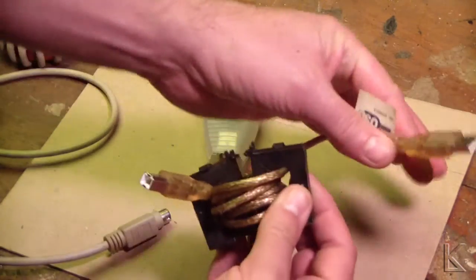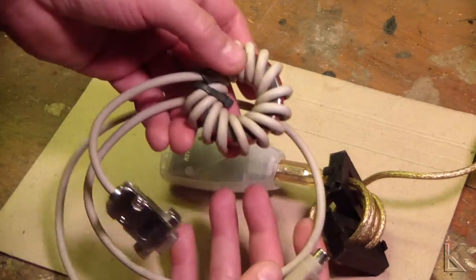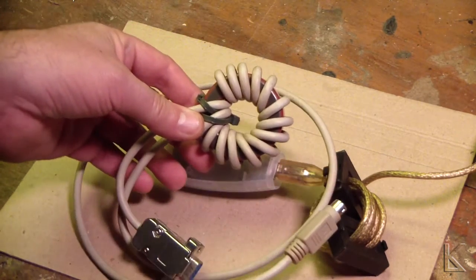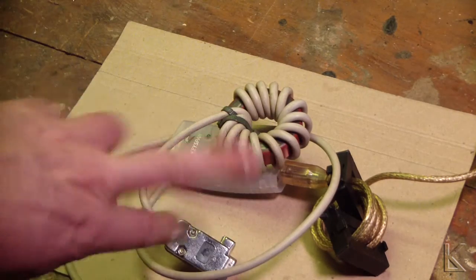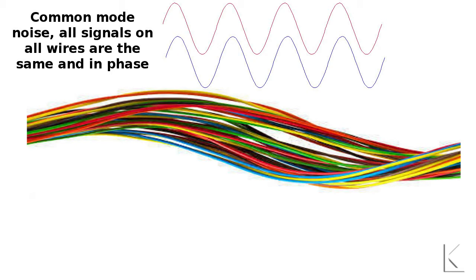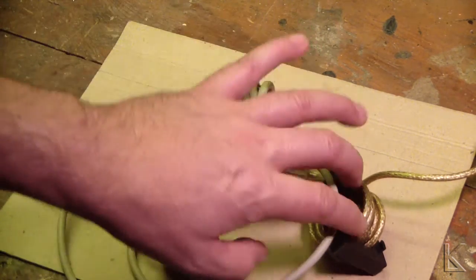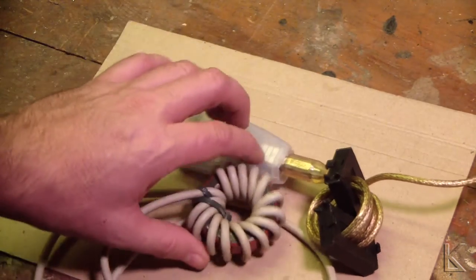So all you need to do is wrap your USB cable around a toroid as many times as you can on the computer end, then wrap the cable going to your radio around a toroid as many times as you can on that end. What this does is eliminate common mode noise. The serial signals you're interested in are differential — they're on two different wires, going in different directions at different times. The interference noise from the USB device is common mode, meaning the same noise signal is present on all conductors all the way down the wire. Wrapping this choke chokes off those common mode signals but does not affect the differential serial signals. So rig control works perfectly, and between these two filters — no more noise, absolutely none, perfectly silent.